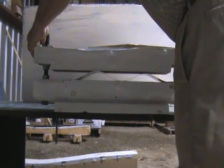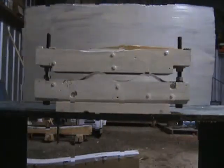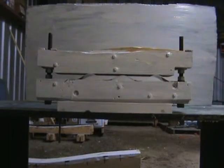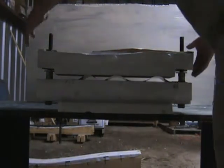The curve shifts to two nodes. At this point the material is supporting the weight of the press, and the weight of the press itself is enough to hold the material in its neutral state. The amount of weight required to push the first bell curve down to two nodes means the weight of the press itself is able to push it down to three nodes at this point. A slight increase of force can push it to three nodes.